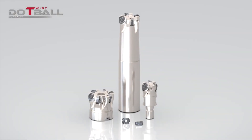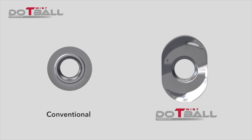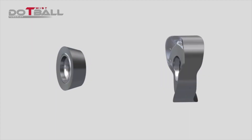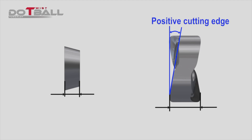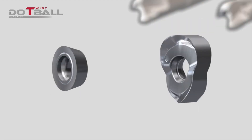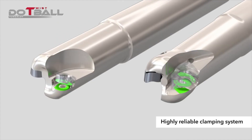But what we've really aimed it at are the cutters that are out there with button inserts in. So we're talking about a tool that's got radii of 4mm, 5mm and 6mm — aimed at the 8mm, 10mm and 12mm buttons. Normally when you're generating surfaces and profiles with a button insert, you're using around about 120 degrees of the insert, which means effectively you get three indexes out of the insert if you haven't damaged an edge already.